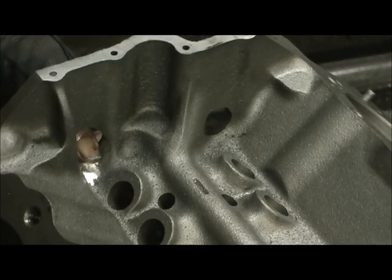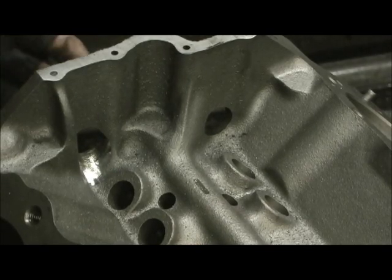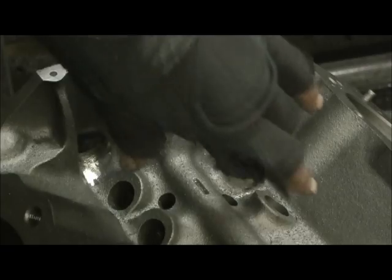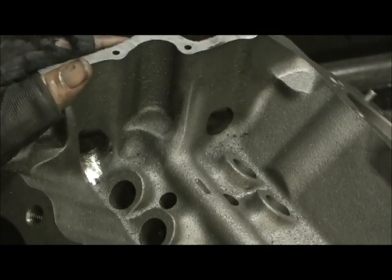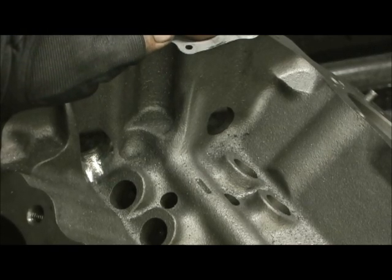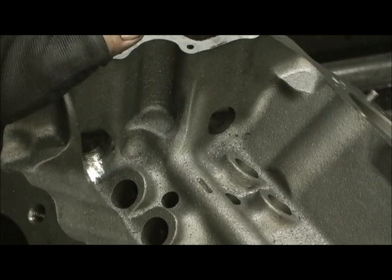Now I've got to work that a while. Remember how hard that rise was going from the galley area over into the timing cover. The problem is that with screen kits - I've got a kit to show you - it comes with two front pieces and two rear, and unfortunately you have to buy two kits. The two that go in the rear have to go into the front instead, and there's no room for a press fit up front and I can't anchor it with a screw. Pioneer, Comper, whoever - they only put two in one box so you have to buy two. Another one of those political bullshit deals.